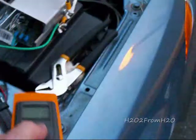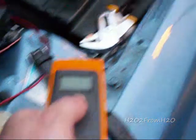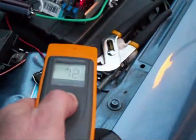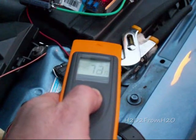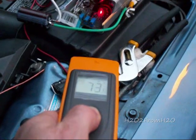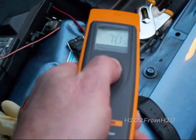I think I'm generating more heat from the internal components of the PWM than from the actual FETs. Looks like the voltage regulator there is putting out about 71.